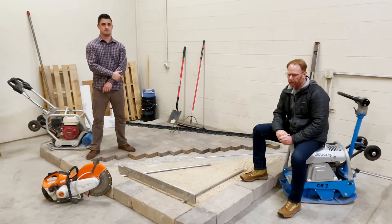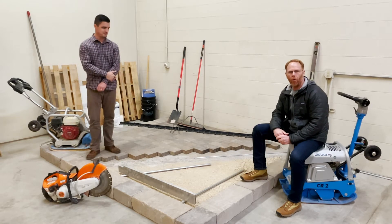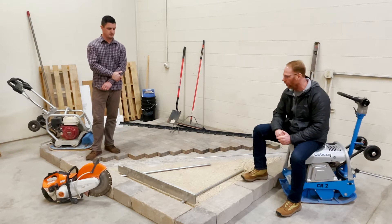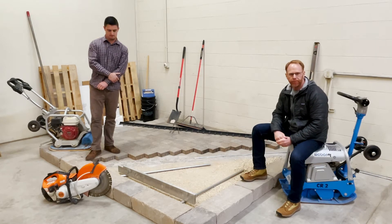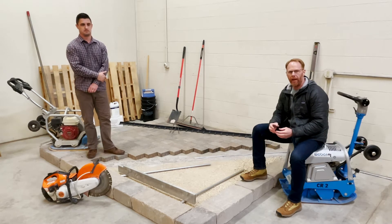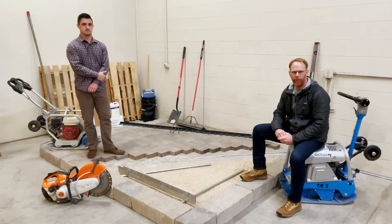Due to Pennsylvania weather, we find ourselves inside one of our local warehouses, where we constructed a demo site made out of our trapezoid garden wall and some materials made available to us for today's demo. Today's feature is sand setting beds and the installation of Hannibal pressed pavers and pressed bricks — not incorporating the Hannibal asphalt block, which will be covered in a subsequent video called the Bituminous Sand Bed.